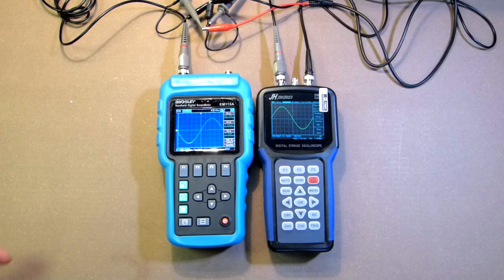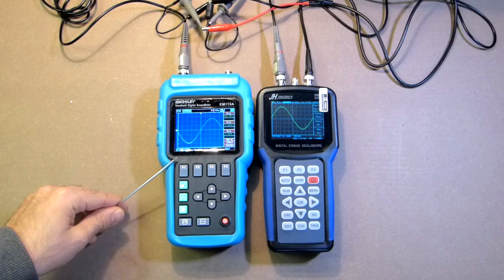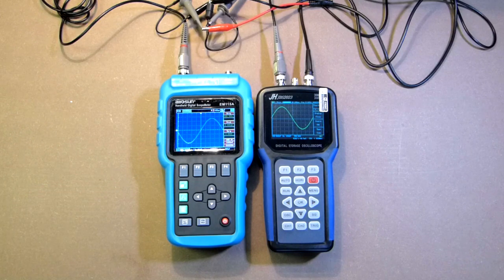As to the advantages of this Jinhan device, its oscilloscope is faster than the other one, and also its maximum frequency for the sinusoidal signal is 5 MHz, and the maximum frequency of the rest of the waveforms amounts to 1 MHz. But in case you don't use the voltmeter, ohmmeter and capacitance meter, you should answer the question, what do you prefer? A fast oscilloscope with a 20 MHz maximum frequency or a 50 MHz oscilloscope?